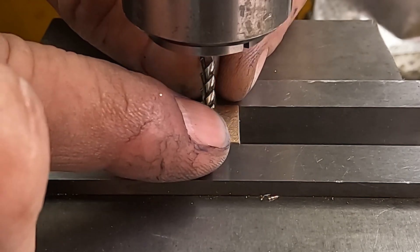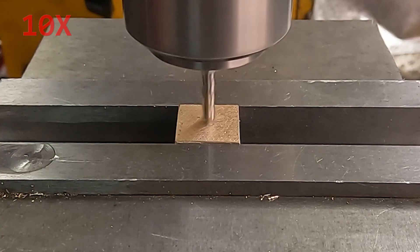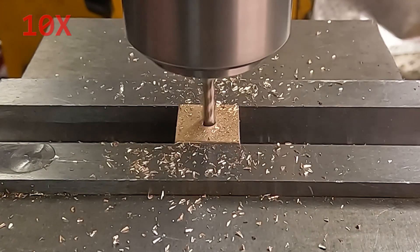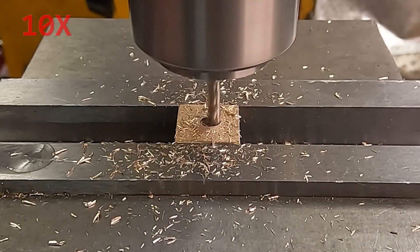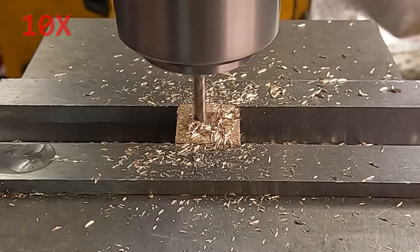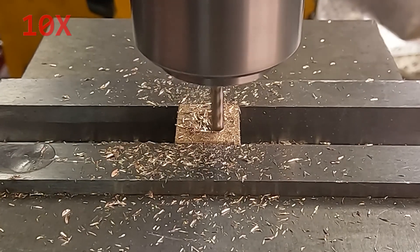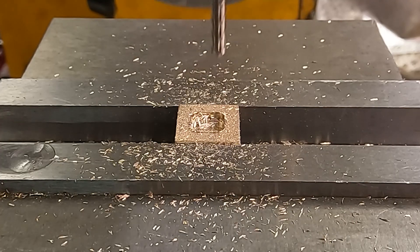This milling operation is depth sensitive, so I'm setting my depth with my brand new baby broken end mill and then plunging to depth — which I think is a 16th of an inch. It's a very tiny cavity. We're just milling this out to a little square which has a 16th-inch radius, which an 8th-inch cutter will give you, and that's all there is to the valve.